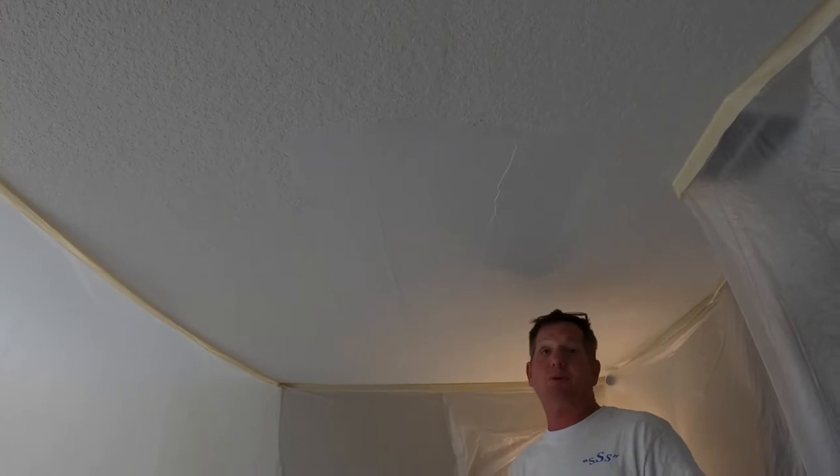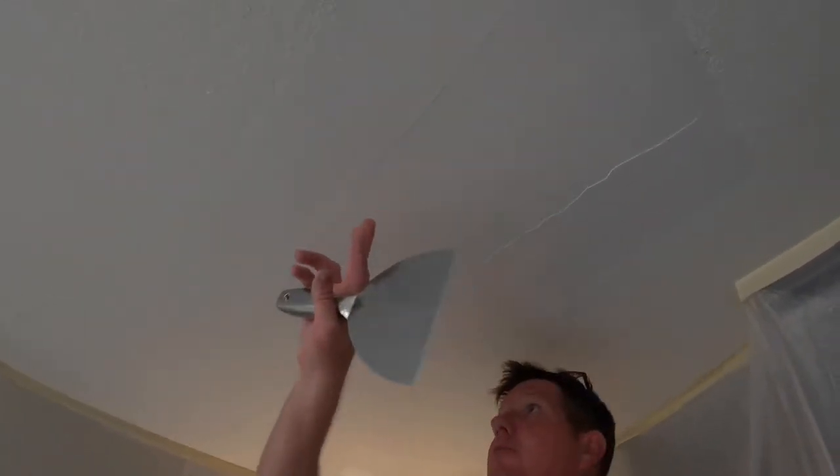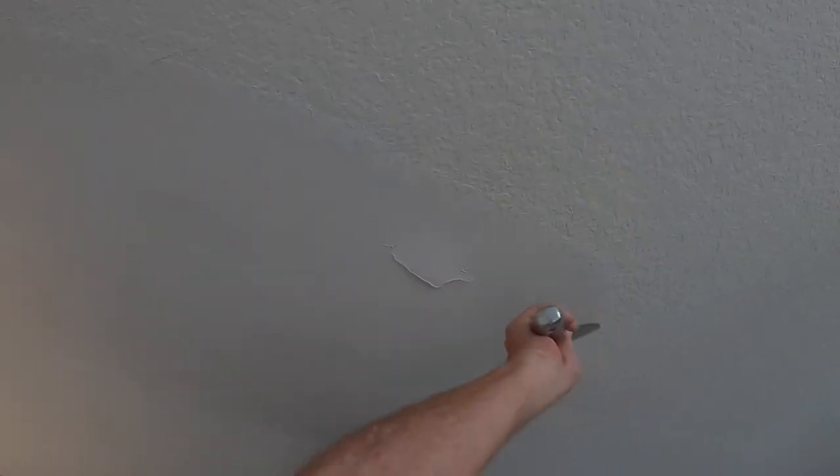The reason I like plaster - you don't have to use plaster to do repair, you can do it over time, but as a professional we try to get in and get out. Seven minutes later, I'm going to do what I call a rake. You can see how this lap mark is kind of thick here. So I'm going to go high side on my knife, almost straight up, and rake it out - because plaster is a molding agent, I'm able to make it do what I want. Any pitholes, any imperfections - with this heavy texture it's about to be knocked down, it's not necessary to skim it. So I'm just going to fill everything in. Everything's flattened out now - the mud's a little bit workable right now, you've got to do it before it dries too fast.